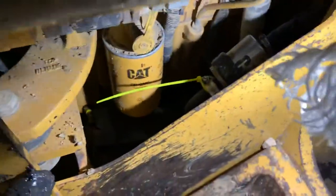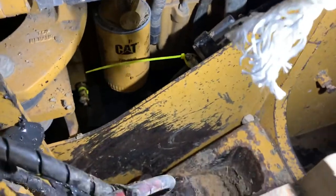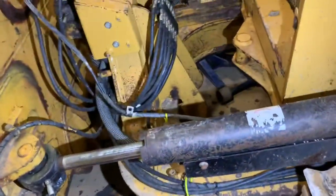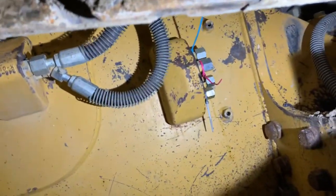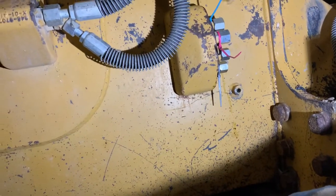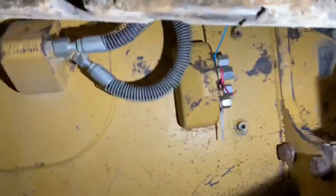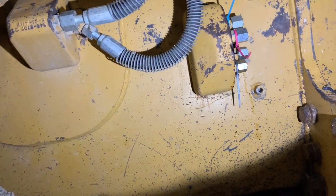If you're working with shifts, be sure you check. I think everything looks good down in there, everything's off over here. Prior shift's work — I don't care if I did it, you better check my work. It's for your own safety. Those top caps right there were left loose. The machine works off solenoids, relief valves, and everything else. You take them liners off and crank the machine — go ahead, do it your way — but they need to be capped and tight. Make sure the old O-ring is still in there when you put that cap on.